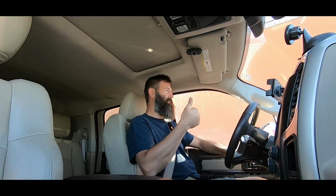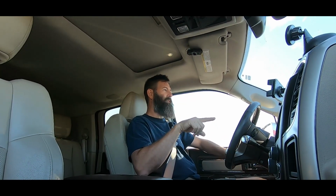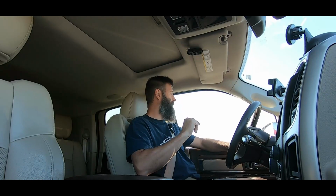Now we've got 2 ceiling fans and a toilet flapper. I think it's a toilet flapper. I'm rolling the dice in that it's a toilet flapper. They say that when they flush the toilet, they have to hold the handle down. And if they just flush the toilet and let go of the handle, it stops flushing. Likely it's a chain adjustment and a flapper. So I've already picked up a flapper and a new lever.